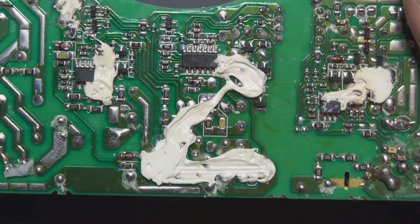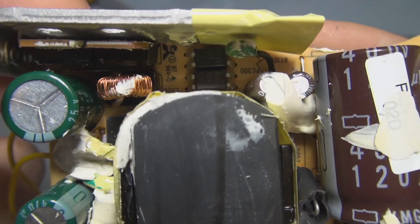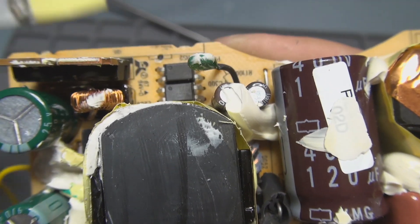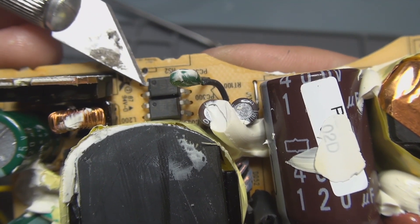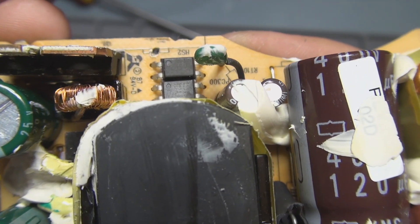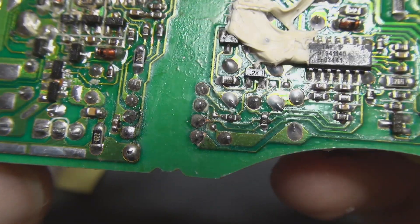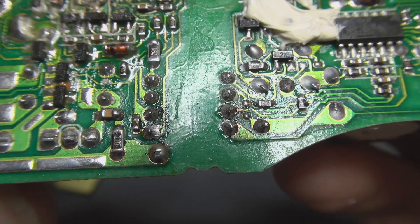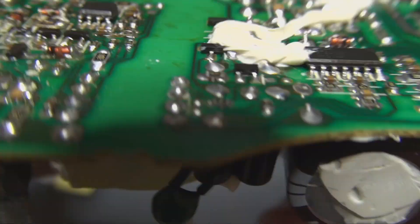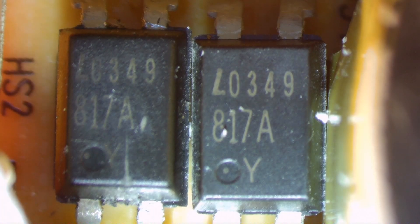You can see nonetheless three ICs, which indicates that this power supply is pretty sophisticated. You can also see two optocouplers, and I have done some measurements on it already and found some strange values. I'm curious to see if they are faulty, and to understand the genesis of this kind of issue I need to make some measurements on these optocouplers.